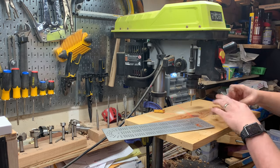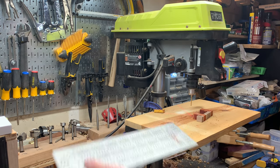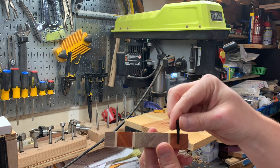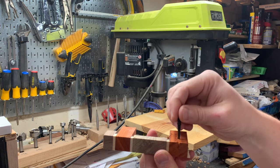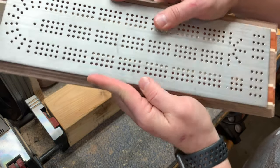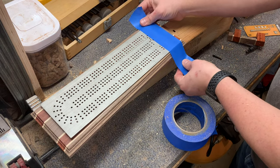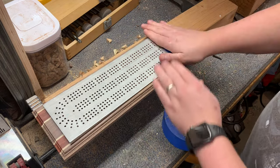First, make sure you've got the depth locked in. Using those off-cuts from earlier will really help — they're already the same height as your crib board and you can test out different depths to see what works best for you. Make sure you have the pegs ahead of time to test it out — cribbage is all about the pegs and the board. You do not want the pegs to wobble, so check that out first. Don't go too shallow, don't go too deep. Then for the template: line it up really carefully, especially if you did that lamination approach. I attach mine with blue tape — you could certainly use carpet tape. Make sure the template is secure and all the way down.